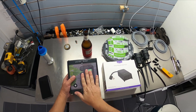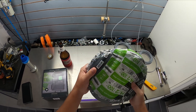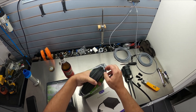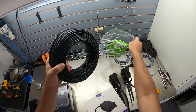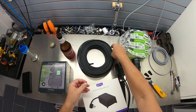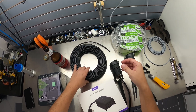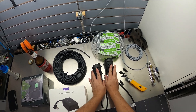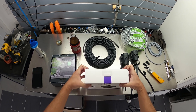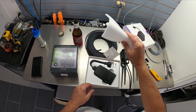You'll need a transformer — any old transformer to get the voltage from 120 plug down to 12 volts AC for your lights. You'll need some wire. I used 14/2. You can try to use 12/2 if you want, but I don't think you need it. 14/2 seems to be really easier to work with. The smaller the gauge number, the thicker the wire. So 14 is basically like what they use in your house walls. You need wire, you need lights, you need a phone, and you need an iDevice. I use these outdoor switches, and I have three of them around my house right now. This is the brains to get you Siri connectivity. So you need one of these.